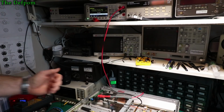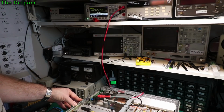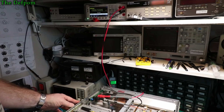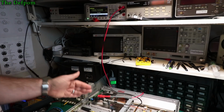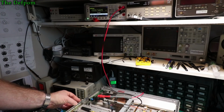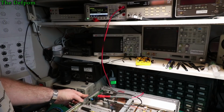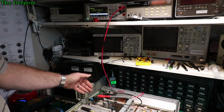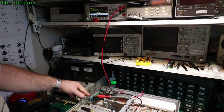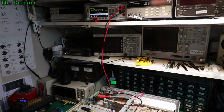Okay, so that's as good as I can adjust it to. I might have to look at the actual circuitry there to see if there's something I can do to bias it a little bit to try and correct those voltages. I mean, I don't know how perfect those voltages have to be. It's only slightly out, you know, it's 0.1 volt, less than that. So, yeah, I prefer to keep it exactly as specified in the manual, but maybe there's some parts which have aged a bit there, so it's gone off value. I have to analyse circuit diagrams for that.